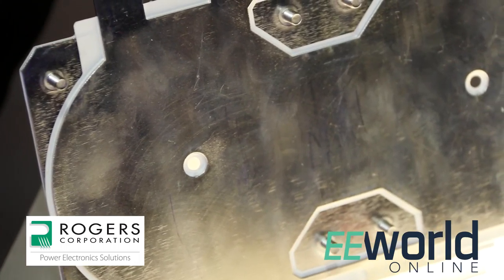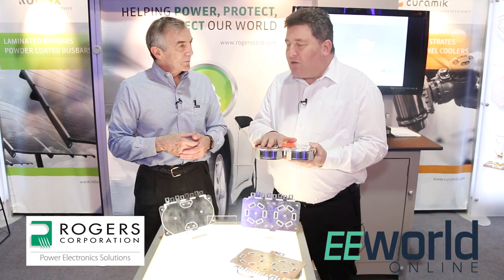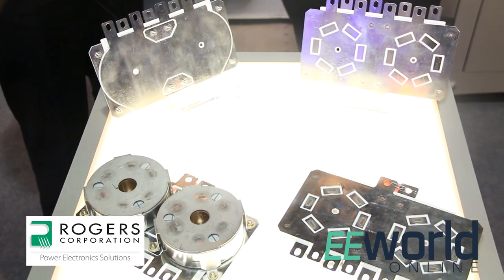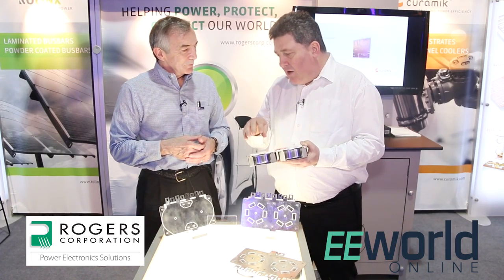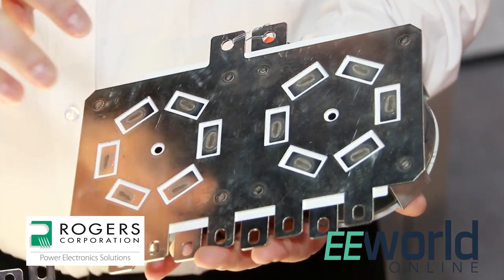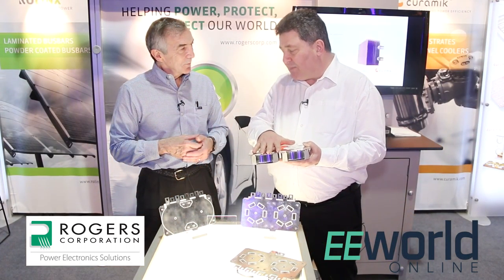The usual way of connecting a capacitor to a bus bar would be nuts and bolts, or maybe soldering them to a bus bar. But really if you want to get to the best low-inductance solution at the taps of the IGBT, you need to really integrate them together. We partnered with SBE who makes these unique capacitor rings to connect them together. As you can see, this is a welding technology that goes directly to the capacitor winding, taking out all of the inductance and only leaving the inductance towards the taps of the IGBT.